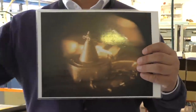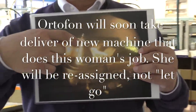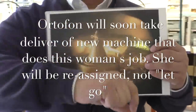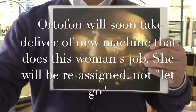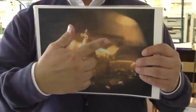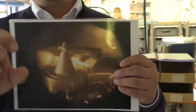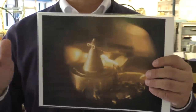All that is something that the new machine is going to do, as you saw Mino illustrate earlier today. The new machine is also taking the diamond, orienting it, and placing it correctly in the fixture. After that, the machine is also taking the cantilevers, bending them, punching a hole in them, and pressing them on top of the diamond, precisely as we do today.